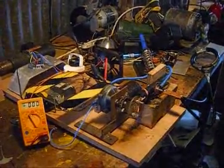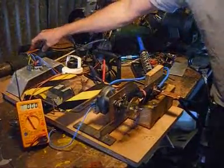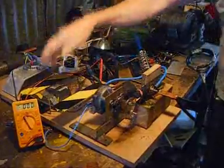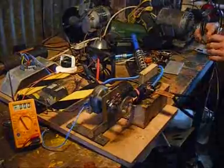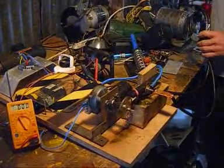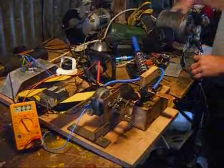What we'll do is switch it on. I should mention, the heat gun here acts as a limiting resistor so the current flowing into the capacitors initially isn't too great. So we'll hear it stop and start as the thing discharges and charges. We've also got a little fan going just to keep the whole thing fairly cool.